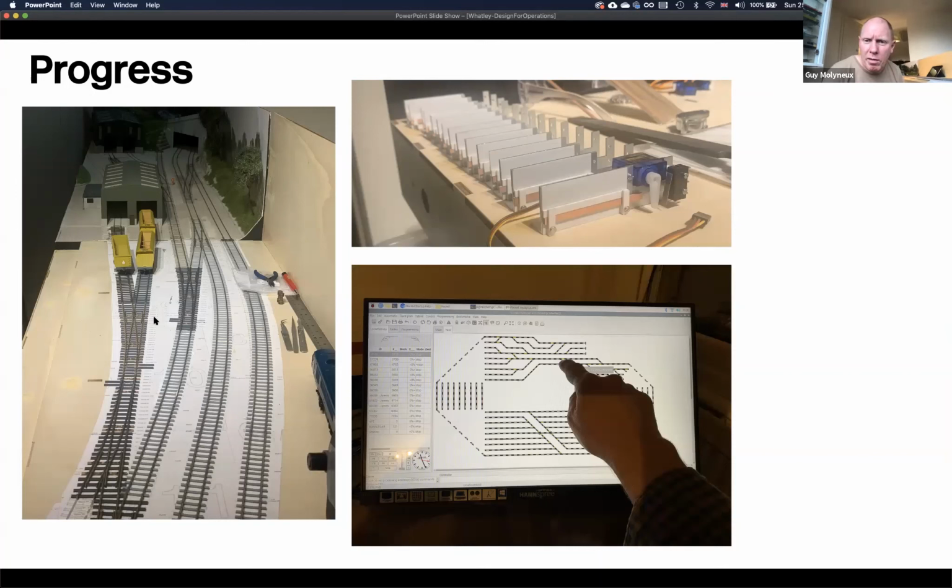And then I've made all of these. These are the switch machines for the points, servo based with a microswitch at one end of the throw. I think this is somebody else's design from one of the fine scale groups. It uses a copper clad sleeper under the board, and it's mounted with another bit of copper clad as an underboard tie bar. You keep the two droppers, solder two bits of brass tube on here, and you can lift the whole switch machine off and swap them out. It's just quite handy.